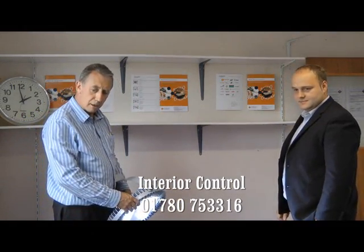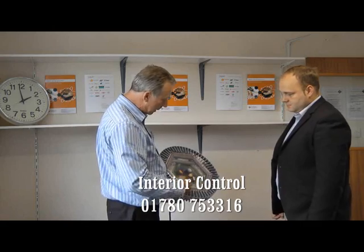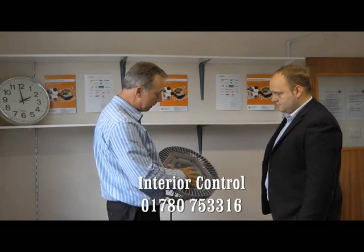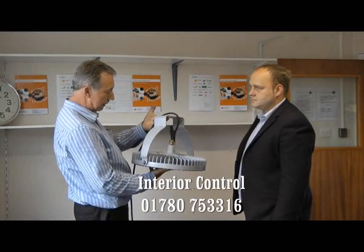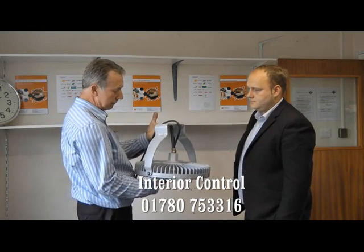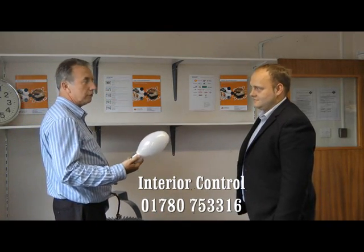If we can turn it off again for a second. Basically James, the clever bit is there are LEDs inside there. They're solid state so they're really tough. It's an IP66 rated unit so that's actually sealed for life. You never get any flies or debris inside the lens so it stays clean, hanging in your warehouse off the roof. You've got fantastic brilliant light because of the colour temperature — this is actually 6,000 degrees Kelvin compared to a conventional lamp that sticks out about 3,000 degrees Kelvin, which is much yellower.